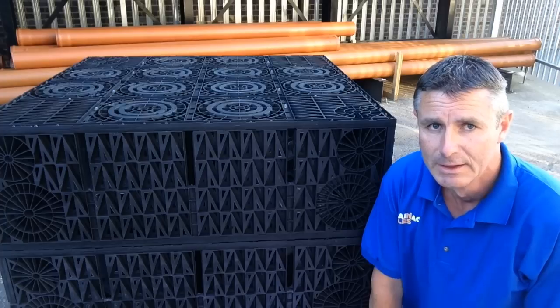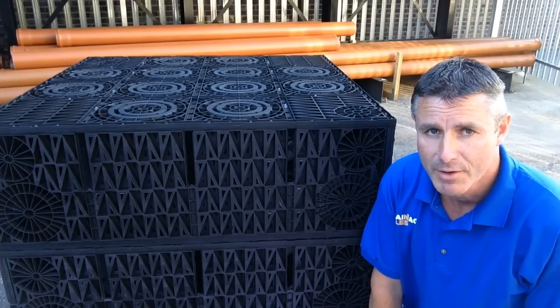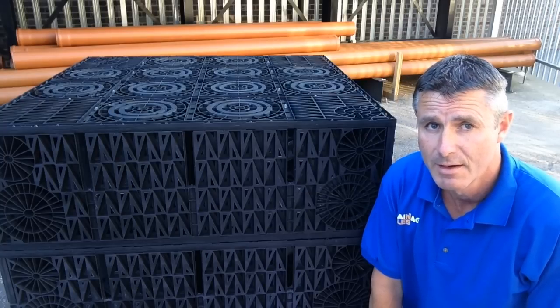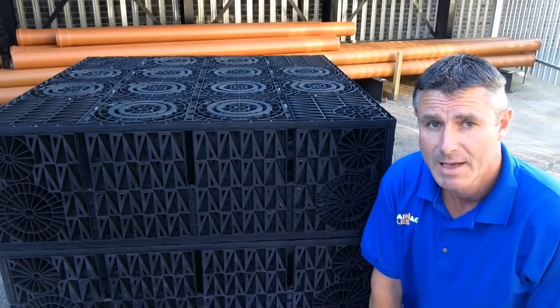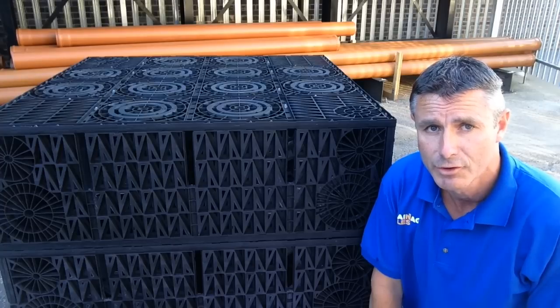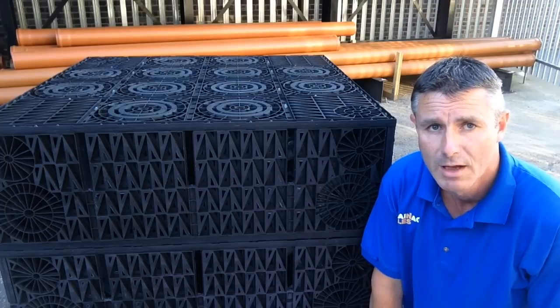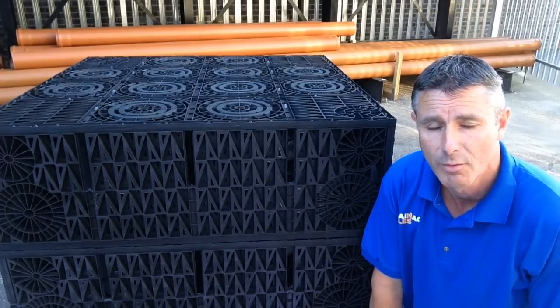to throw in there. Environmentally, a bit of a nightmare, because if there was contamination in there, old paint pots, things like that, and that did happen, then obviously not very good for your soil. Mechanically, it didn't work either, because in a very short period of time, the actual hardcore and the gaps between the bricks and blocks would fill up with soil and the thing wouldn't work. It wouldn't actually soak away.